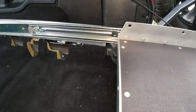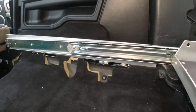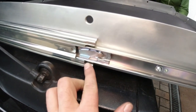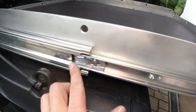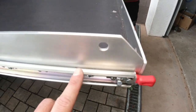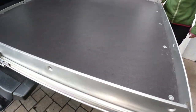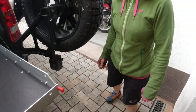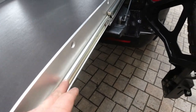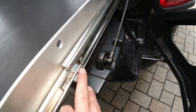And over there as well, we put some shims in, and then there were some burrs here on the rail from the manufacturer. They also slipped and disturbed the function, and then we did a light coat of grease on them. That also helped a little bit. And then we had a lot of patience, but now it's good. There's also the burrs here removed.